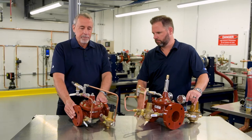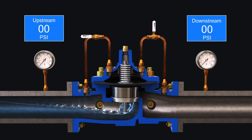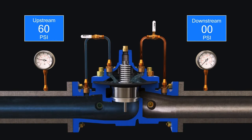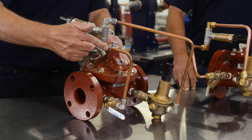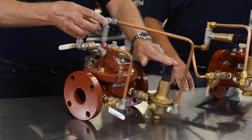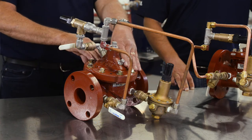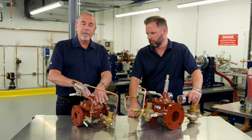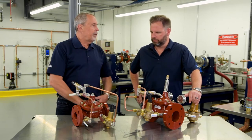One thing you have to realize if you're putting these in: this is not a direct acting valve. This is a simple diaphragm valve. The main body really just holds a diaphragm in the center, and that diaphragm is going to go open or closed. So as water comes in, it goes down, it pushes up the seat, and goes downstream. If you have water on the top of the cap — as you can see, this tubing is coming up through — this device here is an orifice, and it splits and essentially goes downstream through this thing called a speed opening control and onto the top of the valve. So if you put water on top, the valve's going to close. You take water off the top of the diaphragm, it's going to allow water to open fully and pass through.